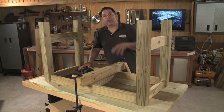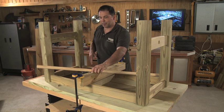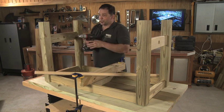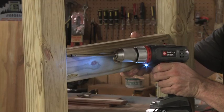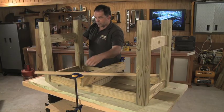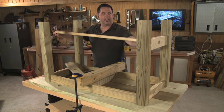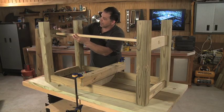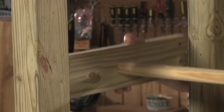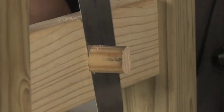And secondly, for those of you who've been wondering how we get our magic footrest dowel in place, this is also that particular step. I've taken all but one screw out of this part of the stretcher. There's the rest of it. Now we'll take our dowel, which I've cut to just over 45 inches. Press it into one end down here. Slide it just like this into place. Now I can put my screws back in, then cut off the excess with a flush cut saw.